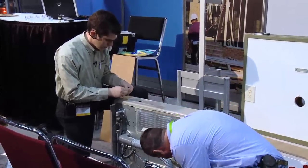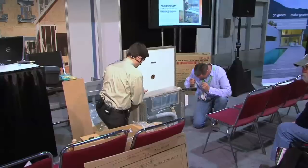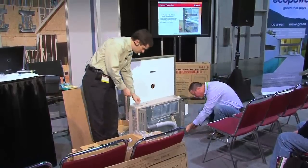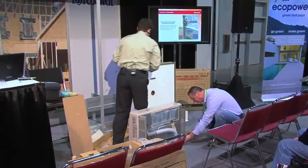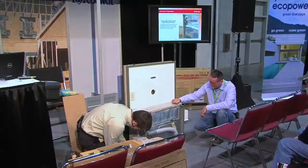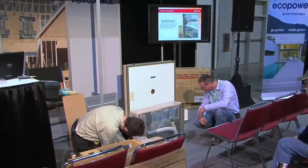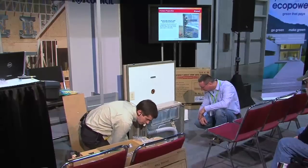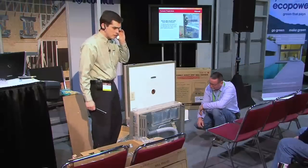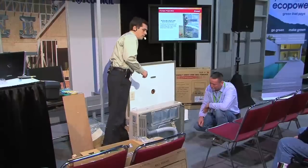We'll open our screw kit. You've got different screws — as I showed you earlier in the directions, it spells out pretty clearly which screws go where. These are sheet metal screws. The easiest way to deal with these is to get it started, go backwards until you hear or feel the screw fall in, and then go forward. That way you don't fight it. So we've got these in place. We're not going to put the top spacer on just yet — that's going to be one of the last things we do.